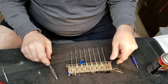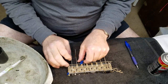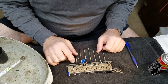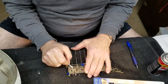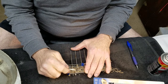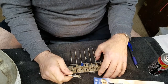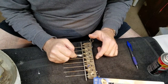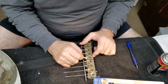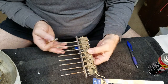I will lubricate all that after I'm done cleaning, but for right now the first thing I'm going to do is clean these little sliding contacts with some lacquer thinner, and then I'll use some Deoxit. Before I go at it with Deoxit, I usually clean some of the grime off the contacts with lacquer thinner so the Deoxit can go right to work. That includes cleaning all the flux off the little terminals. This is where a contact broke off, so this one will never work again. There are sliding contacts on both sides.